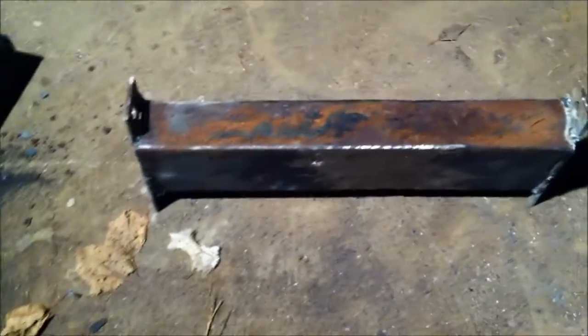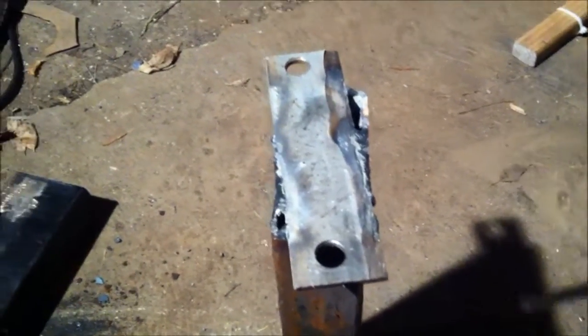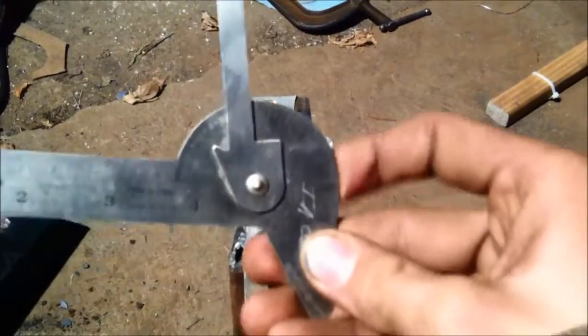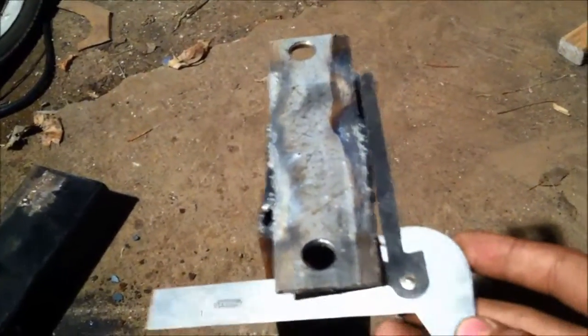Oh my goodness. So this is a 15-inch axle beam. It's a 4x2, and I got those plates welded up on the ends, and that's 8 degrees. It's 8 degrees castered, and it's going to help at speed and turning mostly. And I use this, it's for woodmaking, but you can kind of see. You can't really see, but there's 90 degrees, and then you go 8 over, so that's 82 degrees. I hold it up underneath when it was loose, not tacked or anything, and I get that just right, and then I weld it in. So that's what 8 degrees looks like.